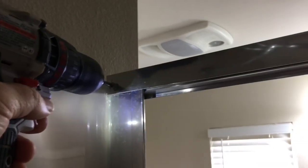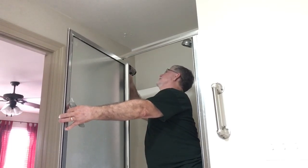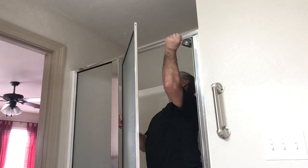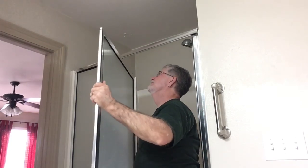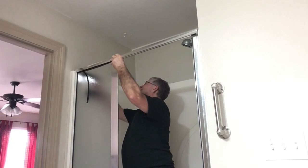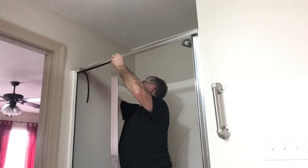The first step, I'm just going to release the suction cup grab bar and get that out of the way. The first step in removing the shower glass doors is removing the screws at the top. There are several different screws to be removed, and you want this glass out of the way to begin with so you don't have any danger of having an accident. With the screws removed, all you need to do is raise up on that top horizontal bar. In some cases you'll have to cut the silicone, but in this case it just lifted right up, releasing the door. There was one more screw to release, and then I was able to lift off the top bar and remove it completely.